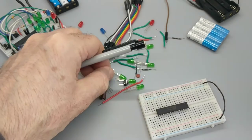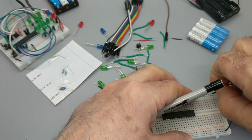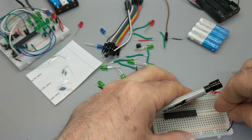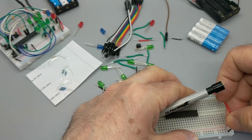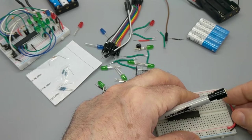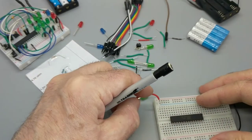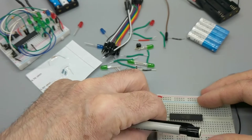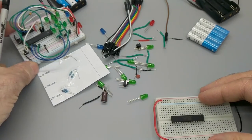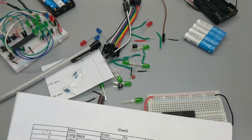Step two, join up the positive rails. Positive rail. Come on, positive rail. Now, I don't join it right next to each other. I put a little distance on it, just because if these things leak out a little bit... here's an even better idea. Why don't I do this? This keeps the wires from contacting each other in case of a little knockout. I think that's pretty safe. If the wires were halfway sticking out, it would prevent short circuits from the two wires touching each other. Okay.